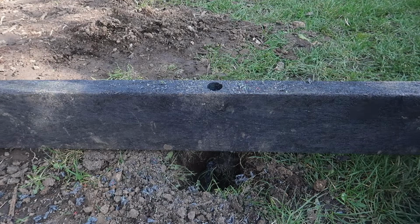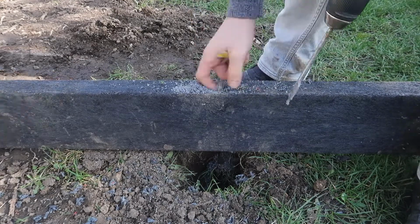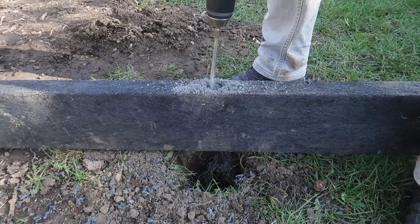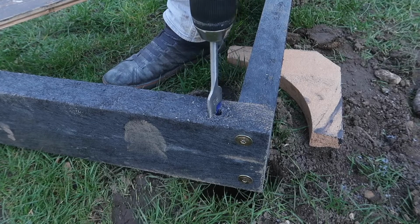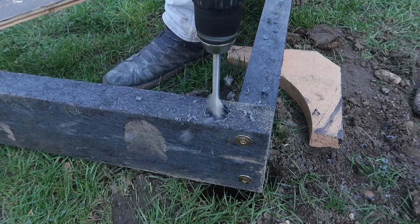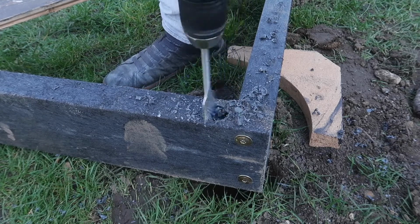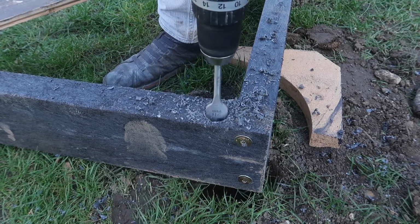Now, another tip, when countersinking a hole with one of these flat drill bits, it is always better to first drill the larger hole and then the smaller through holes like I did here. If you do it the other way around, the tip of the bit has nowhere to center on and to dig into, and then it will jump all over the place like it's doing here.